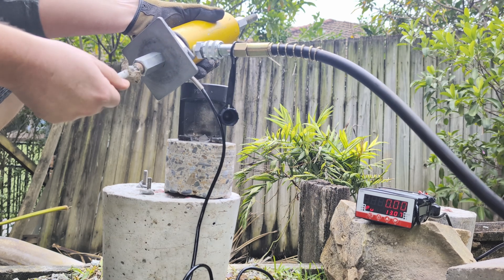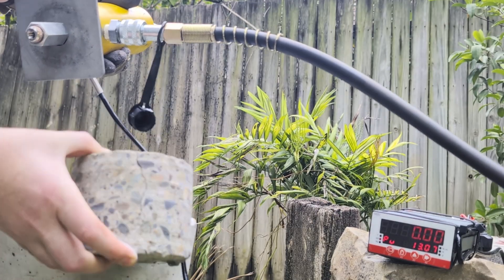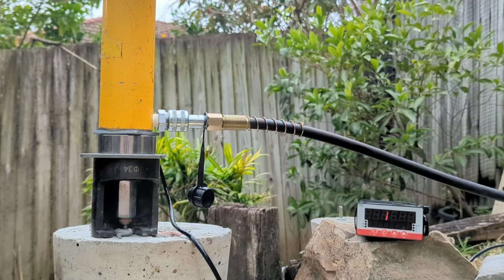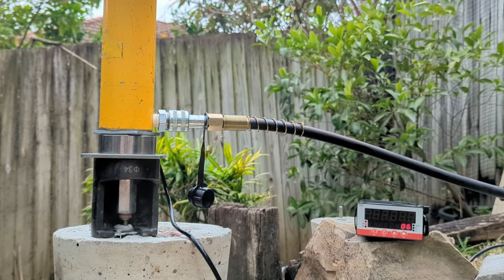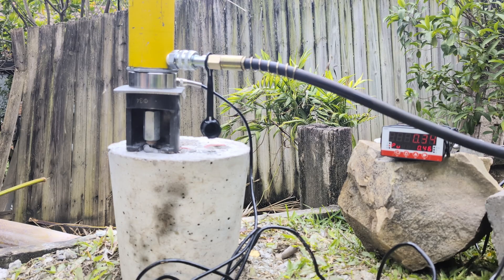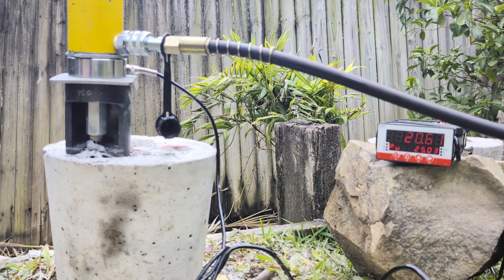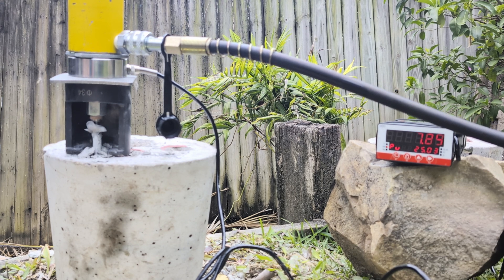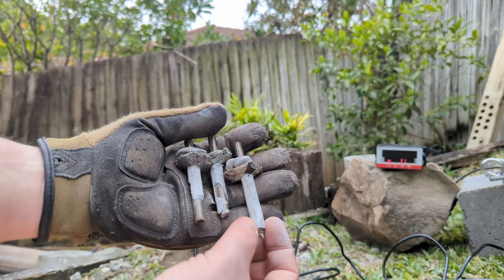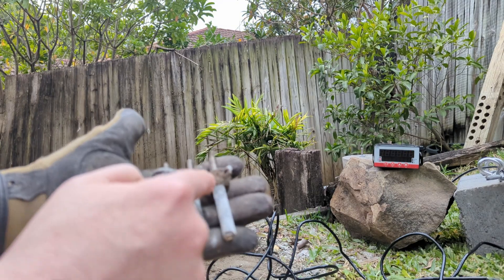Not very strong — 24.94 was the peak, and it's the first time we've had polyester crack this block, but it's a pretty small block. Second one: 24.06. Third polyester: 25.03. Very nice and consistent. Pretty standard pull-out failure here — we've got the glue-concrete interface where it all failed, and a small cone just on the surface.